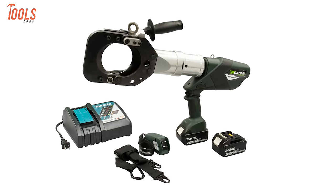The Stringing Gun Easy 300 Pull Line Blowing Tool by Zeitler is specifically made for professional electricians and stands out as an efficient solution for network construction, requiring no electrical connection. Powered by a robust fuel engine, it independently feeds the pull line, making it versatile in various applications such as civil engineering, groundwork, roads, tunnels, bridges, snow cannons, and cable car connections. With wide applicability for cable ducts ranging from 25 to 200mm internal diameter, the Easy 300 excels in its ability to handle diverse settings.